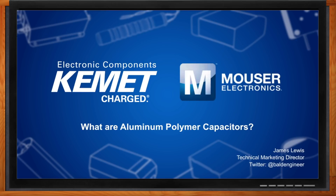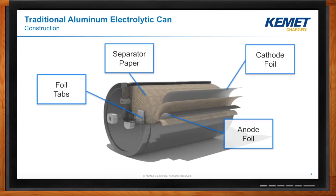Let's start by talking about what's inside of a traditional aluminum, and then we'll get to the polymer stuff in a few minutes. Looking at this picture, I've got a can that we've kind of exploded out a little bit. There are two key things inside the can: the anode foil and the cathode foil, which are the electrode plates providing our positive and negative connection. In between them is a separator paper, which separates the two plates so we don't have direct contact. Foil tabs are connected into them, providing the actual terminal connection. The electrolyte is actually hiding inside the paper separator — we impregnate the paper with the electrolyte itself.